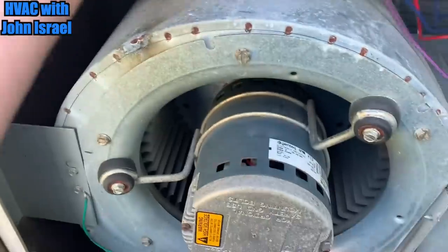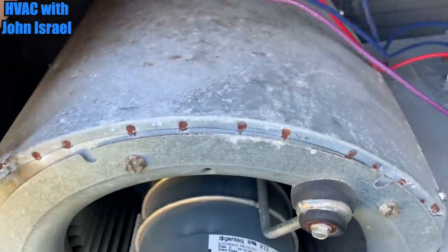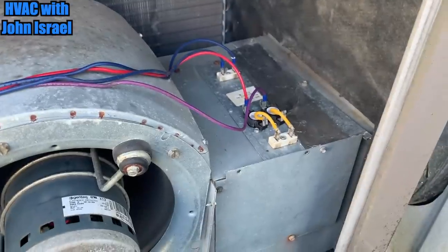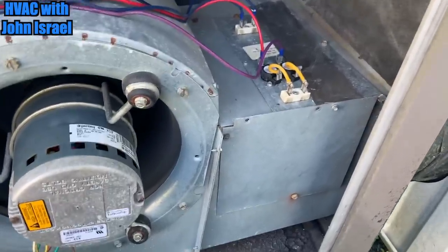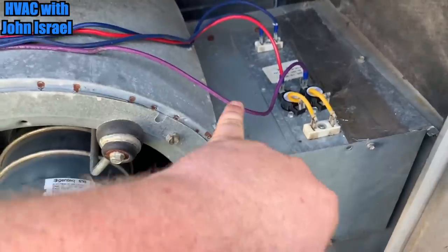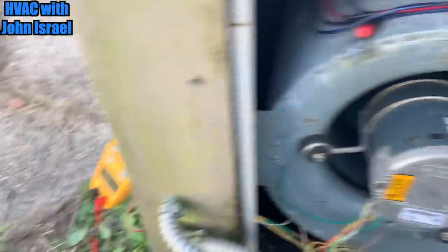I'm gonna get these wires off of that blower cabinet somehow. Right now I just want to see if the heater will stay on. Alright, we've been running a little while. We have our full 40-something amps now. We were getting 5 kW on the red wire and the purple was dropping in and out — we had a loose connection. I fixed that, and a loose connection on that limit switch. I fixed that. And ever since then we've been okay.